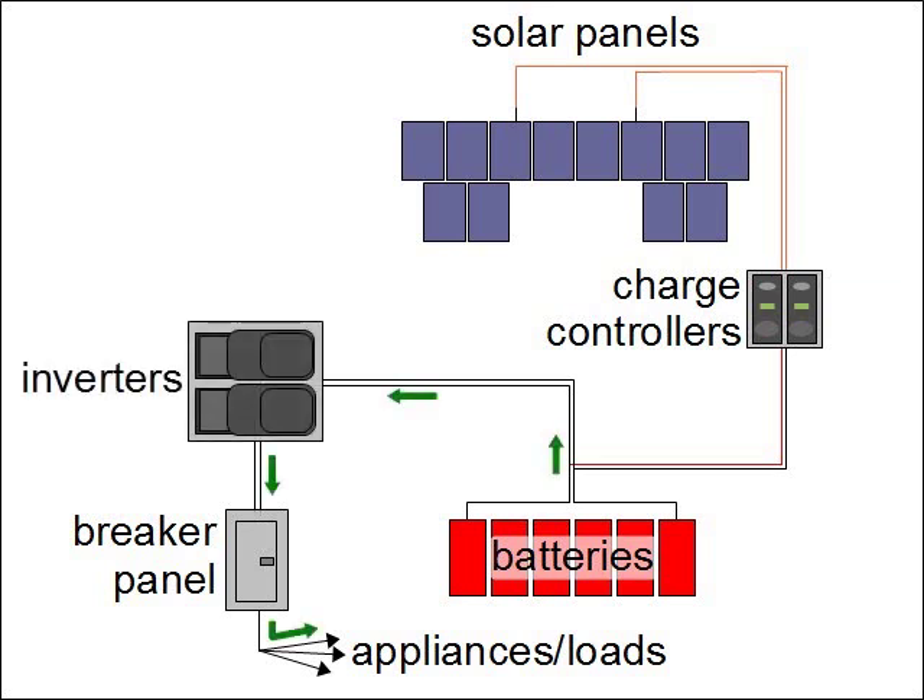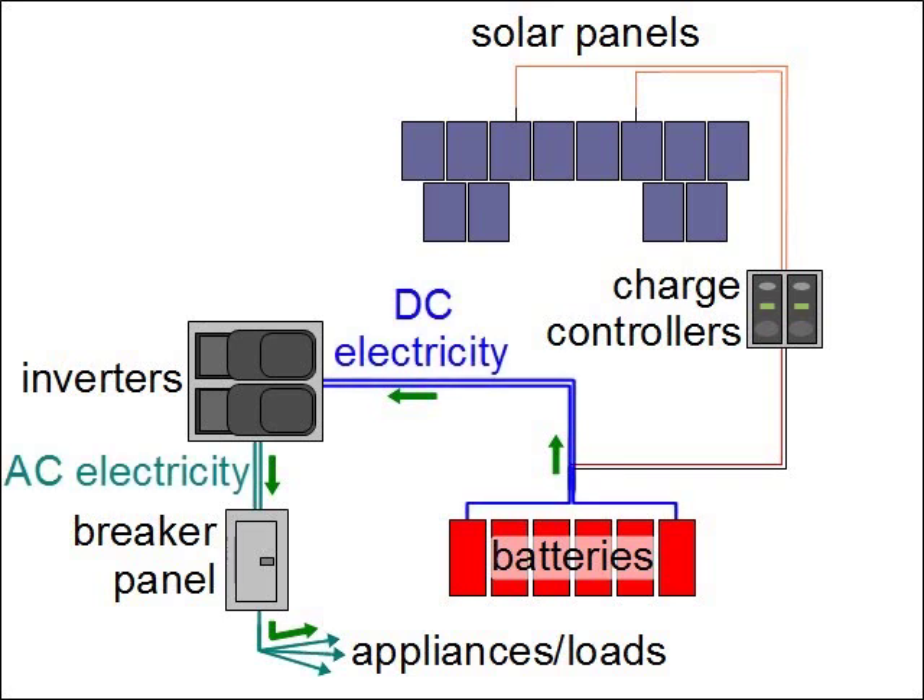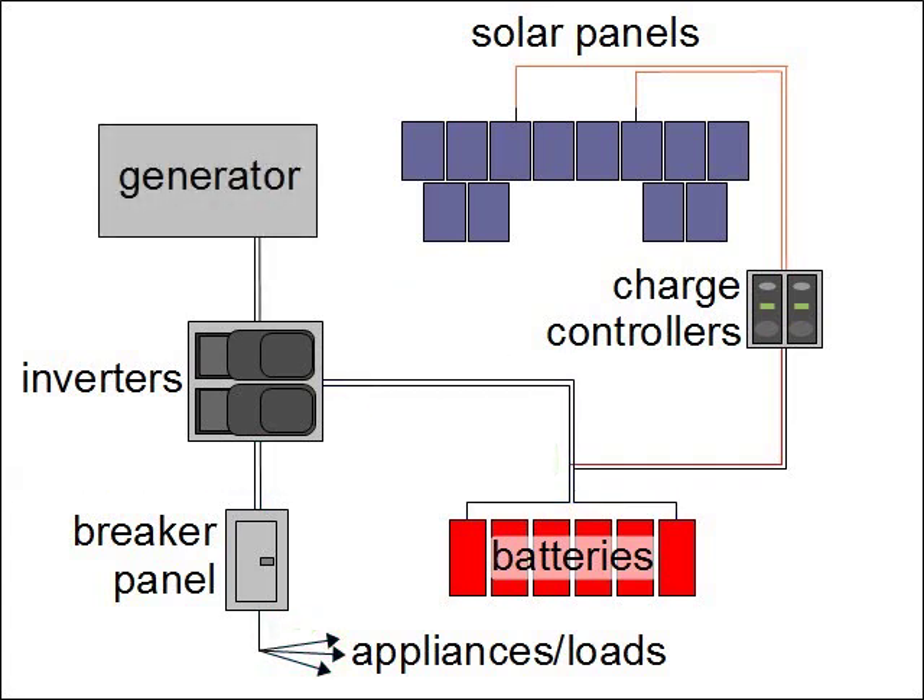In this case, we don't take the power directly from the batteries and send it to the breaker panel. We take the power stored in the batteries and run it through these inverters, which then send it out to the breaker panel and onto the various appliances. We do this because batteries supply DC electricity and our loads require AC electricity — the inverters convert from DC to AC. But here in southern Ontario, Canada, during some winters we might get an entire month without really good sunlight. That's why this system has the backup generator, to generate power when the solar panels can't keep the batteries charged. The power from the generator goes into the two inverters, and from there to the breaker panel and then to the various appliances. We have two inverters because we have such a large generator. The inverters can also use power from the generator to charge the batteries, so the batteries can be charged using power from both the solar panels and the generator.